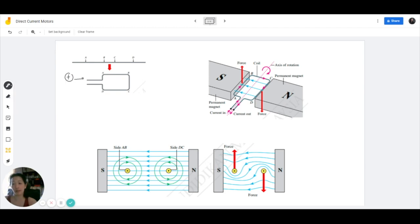So imagine if this side was positive and this is connected to the negative terminal. This coil is exactly the same as this coil over here, so that's how we've got current flowing in this direction and then flowing out the other direction. Now based on what we already understand about how induced forces can be created, we have current flowing in the wire here and it's cutting across the magnetic field. Based on Fleming's left hand rule, we'll find that AB which is on the left hand side will generate a force upwards.